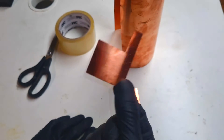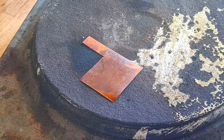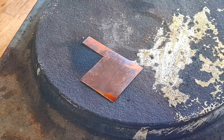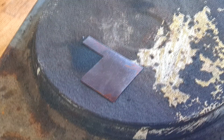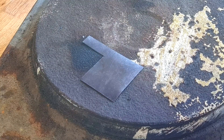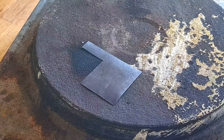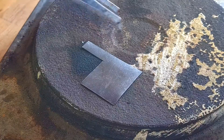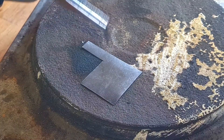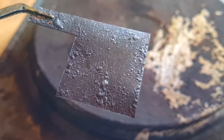And this I will do right now. After 20 minutes I get an oxide layer on the surface of this electrode. Now I need to slowly cool down this electrode. After cooling down, I will gently rub the surface to get to the red copper oxide.